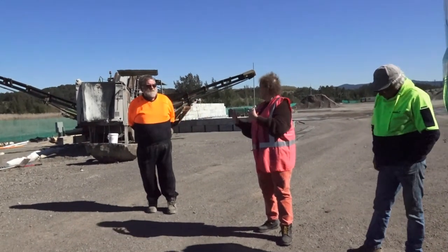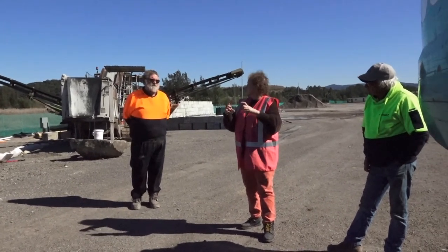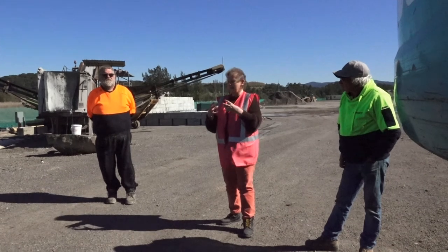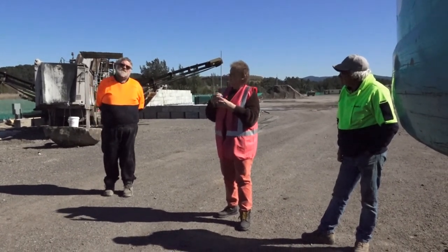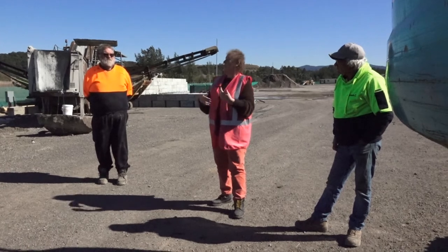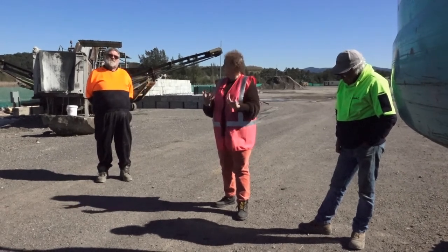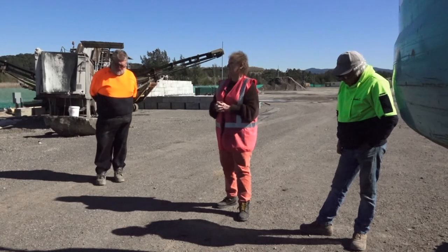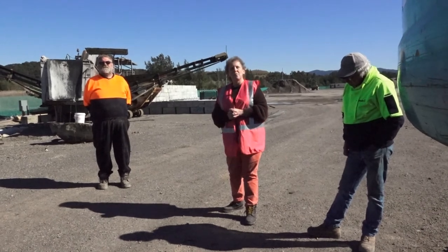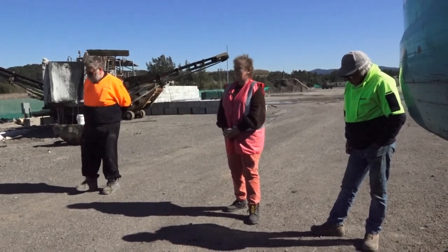I just want to give you the reason so you feel more comfortable. Because hydrogen's new, the industry have not regulated electronic mechanisms because they don't want wiring directly to the cylinder. Until they can make a pressure gauge that's intrinsically safe, regulations won't let you have an electronic gauge at this point. The government's still getting used to what they're going to do. They're trying to copy as much as they can from CNG standards, but because it's all new to the government, until the manufacturers and the government set the standards, we can't add things to it that would be non-compliant. Copy, Benny. Copy.